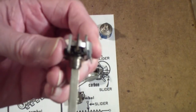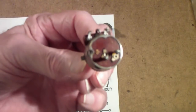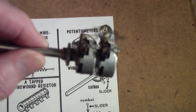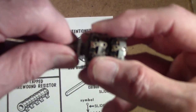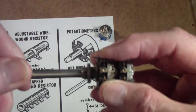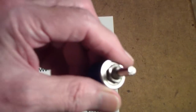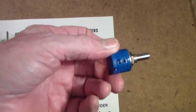This is a single potentiometer. Here is a single potentiometer with a switch, usually used for turning the AC power on. Here is a ganged, two-gang potentiometer — these were used where you needed to have two resistors that tracked each other, for example a volume control in a stereo. There also is a kind used more in instrumentation called a 10-turn pot that you may see from time to time, though unlikely in a radio.